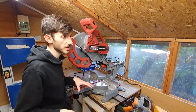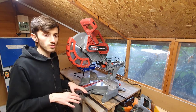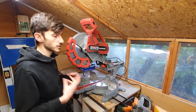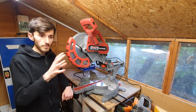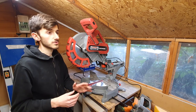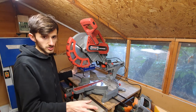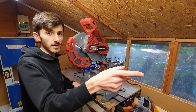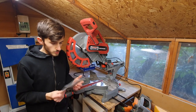Just a quick note: my shed is only small and I've only got a tiny electricity board. This saw was too big for my shed in terms of power, but that's not anything to do with the saw — that is purely to do with my setup. So just make sure that your shed or workshop can take the raw power of this saw, because it is a 2000 watt machine and the inrush current of electricity made my shed struggle to keep it on. I've currently got it from an extension lead from my house. But we can finally jump into the video.